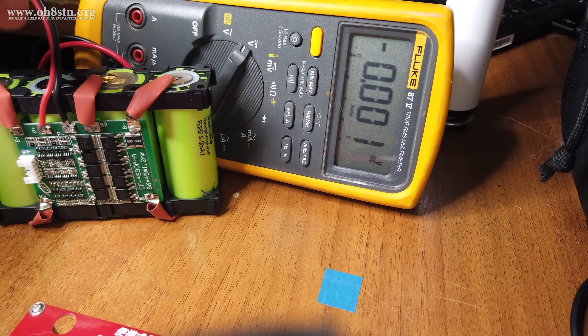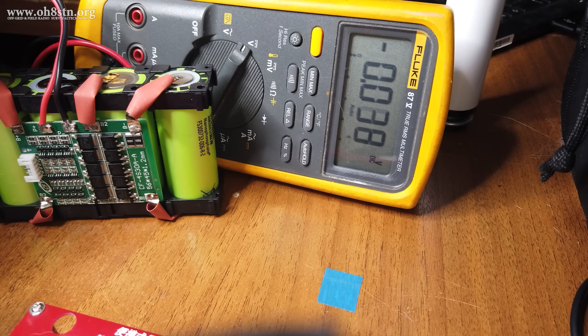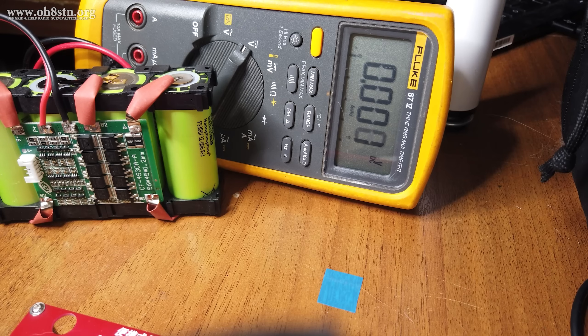I've got my Fluke meter out and added a couple of Anderson PowerPole connectors to the discharge wires on the battery pack. What we want to check for is voltage on that discharge port — 13.46 volts, I'll take it. If you find any voltage lower than 12 or 11.5 volts, there's probably something wrong with one of the cells. Use your multimeter to check the cells individually. If you have zero volts, you can bypass the BMS using your voltage probes on the plus and minus of the battery pack itself. If you get voltage from the pack, it means you need to activate the BMS by plugging in the charger.